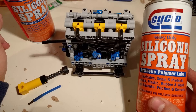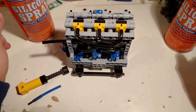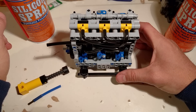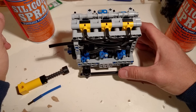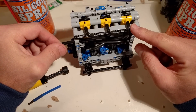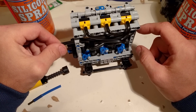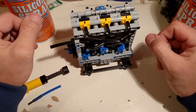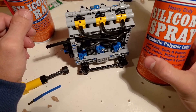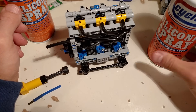Many people want to use WD-40, which is an oil-based lubricant. Oils, especially mineral oils, contain acids which are not good for either the plastic or the rubber seals inside the cylinders. Also, because it's oil-based, it's messy. Silicone-based lubricants are clean, so this is what we will use.